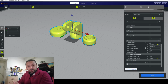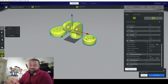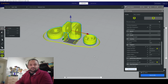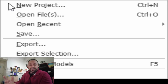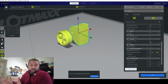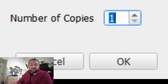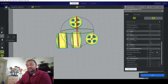And obviously, when it comes to using the SC10 Shark V2 3D printer as a laser engraver, you will need the Lotmaxx software to laser engrave after you install the laser engraving kit on the Shark V2. So to say, it works with Cura, it works with Simplify3D. I have used Simplify3D and it does a very, very good job. Basically, it prints faster, I don't know why, with the G-code files created with Simplify3D. But again, maybe it's because in the Lotmaxx software I'm printing with 0.16 millimeter, the fine prints, and in Simplify3D I use 0.2 millimeter, which is a normal print.